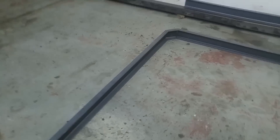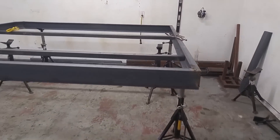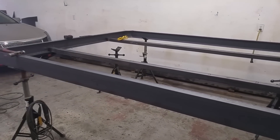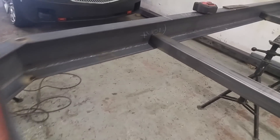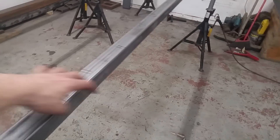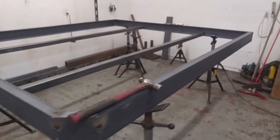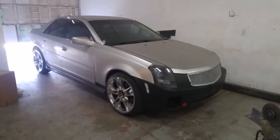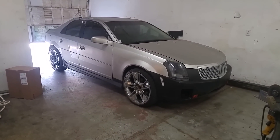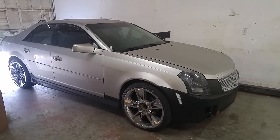That makes it much quicker and easier because you don't have to figure it out as you go. I've got them all up here in stands and tacked it all together. Went together pretty nice — got these metal square tubings coped into there so I can put my angle iron on top and then the wood sits on top of that. It's all welded together and supported nice. My car went in for inspection today and it passed, which is pretty sweet. I'm pretty surprised — usually they get you on something every time, but it just passed first go.